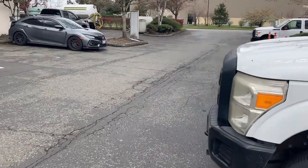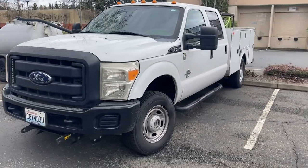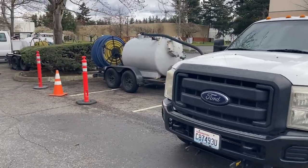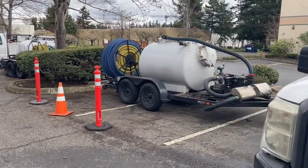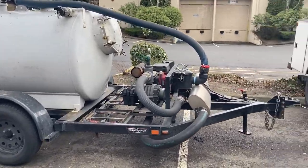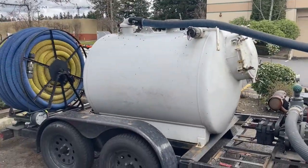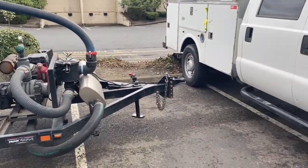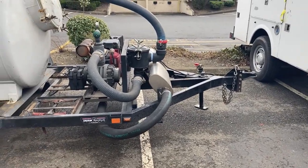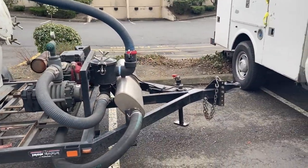So when you're doing this kind of equipment, you wind up having heavier trucks that are sort of like 10,000 pound gross vehicle weight trucks. But if you stay under 10,000 pounds, you're less likely to be interacting with the DOT guys on the freeway, which can be sticklers about lights on your trucks and brakes. And it sucks when you have a DOT guy pull you over and put your trailer out of service because you had dual rear wheels instead of single rear wheels, which put you in their weight jurisdiction. And now they're eyeballing every little thing on your trailer to make sure that it works.